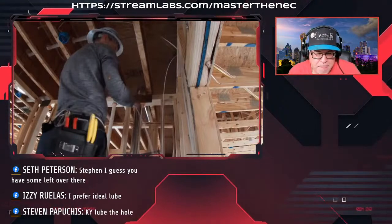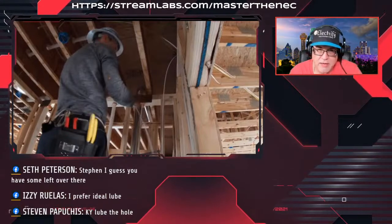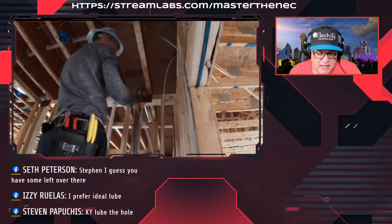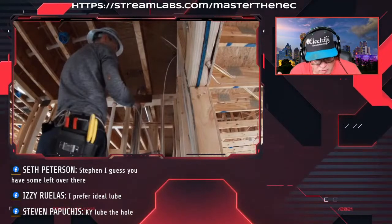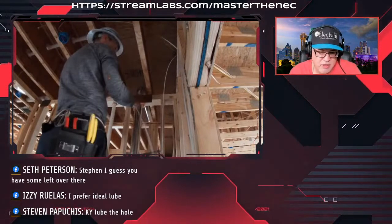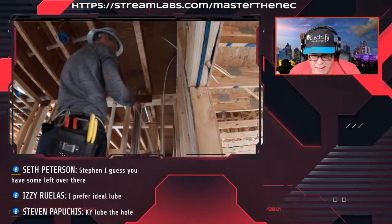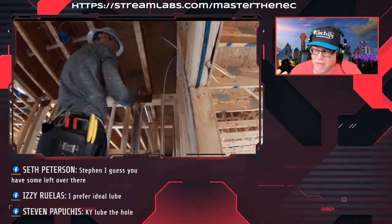Theoretically, when you have PVC, typically you don't want to install it in minus 10 degrees. Now, if you have thermoset, like an XHHW-2, you can go down to minus 40 degrees. But the reality is that sheathing is PVC. And so if you're going to be doing it in a temperature, again, in this case, 32 degrees or even lower, anytime you're going to be freezing or lower, then you want to acclimate it to the condition. So I would keep all of my NMB in an above freezing environment until the time that I'm going to install it. So keep it wrapped up. Obviously with the cost of NMB today, you ain't leaving that on a job site, I can promise you that, right?